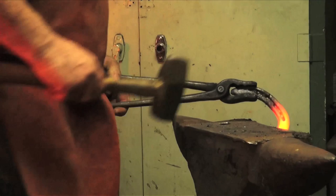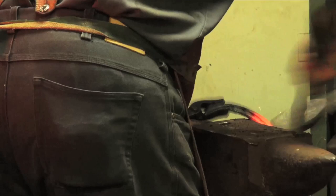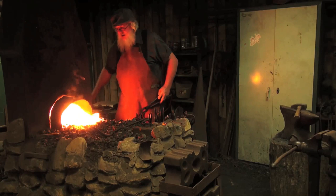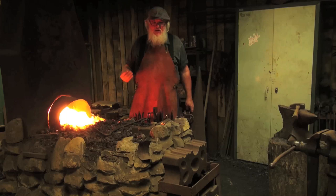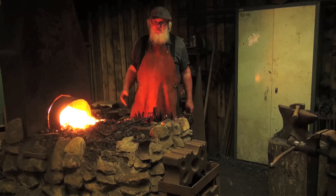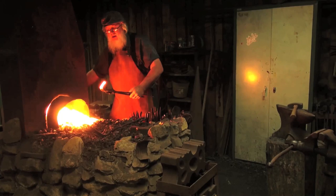I'm going to straighten this out a little bit — that's where the blade is going to be. Next I'm going to heat it up and take some of the curve out of the whole shoe just so it's a little more comfortable in your hand. I like to leave the end of the shoe and the slotted nail holes so that when you look at it, it's obvious this came from a horseshoe — that's part of the novelty of repurposing stuff like this. Like everything you do in the blacksmith shop, you've got to get it hot and hit it hard.